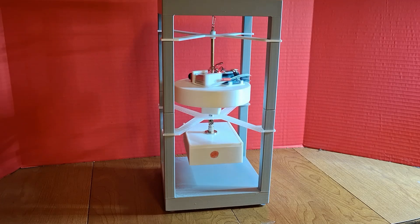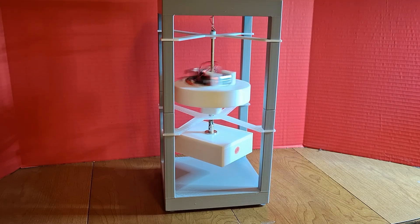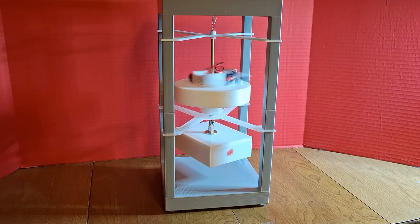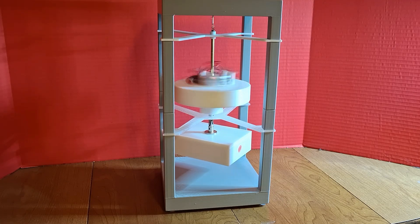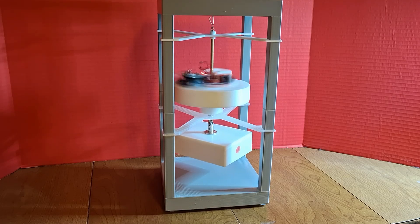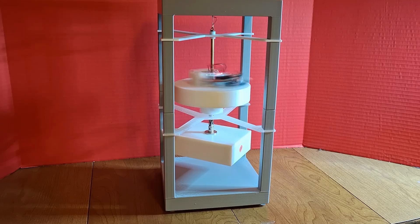I get asked a lot why I call this magnetic propulsion. This motor here is not actually magnetic propulsion, but it leans heavily into the concept of magnetic propulsion for satellites or sea vehicles. This is a compass motor. The pod at the bottom — that square box with the red dot on it — is filled with magnets. The red dot is the north end of it, so the magnets want to point north. There's an N20 motor above where the U-coupling is, above that magnet pod. The N20 motor spins and pushes against that magnet, and the torque of the magnet in Earth's magnetic field makes the armature on top spin around. This is just a concept motor; I don't expect anybody to think it has a practical purpose.